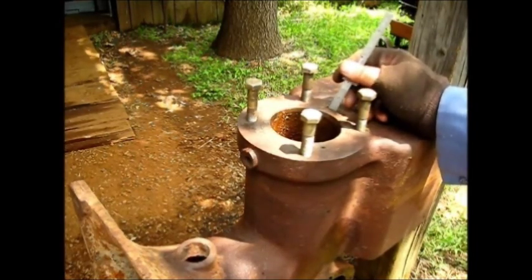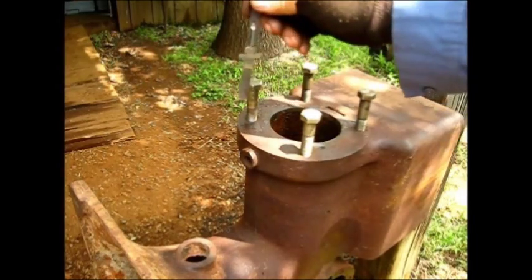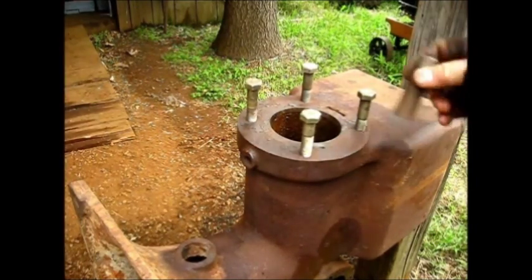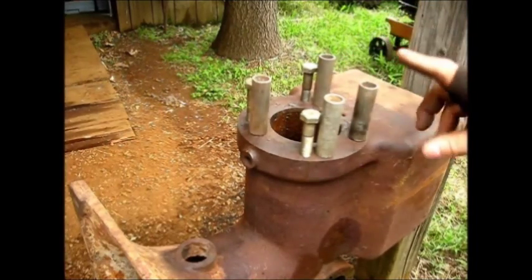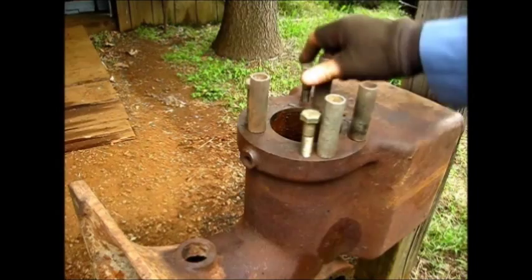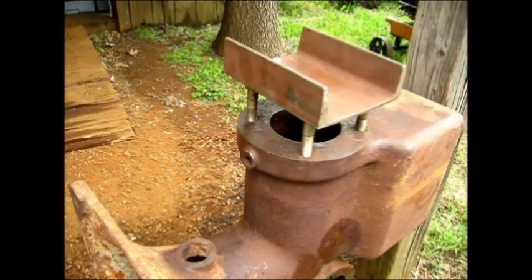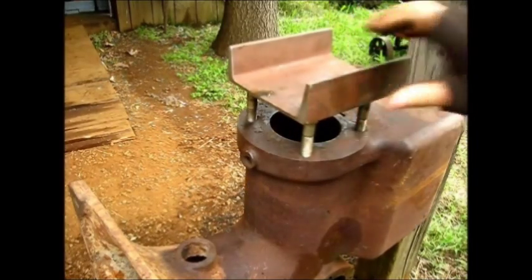What the setup I've got here is four bolts, and you should take the time to get a ruler and set all bolts at the same height. If you have your head bolts in your engine, you can also cut four standoffs — four pieces of pipe. It doesn't matter what length they are, just so they clear the threads on the longest bolt. Make all of those the same length and put one on each head bolt. This is just a piece of angle iron — happens to be five inch. Use what you've got. I've just cut a piece of angle iron and drilled a half-inch hole in the center.